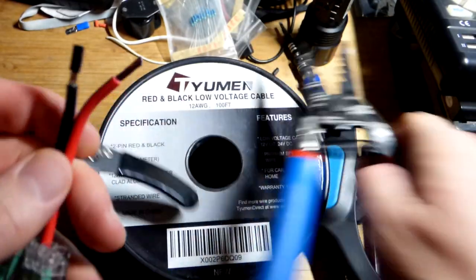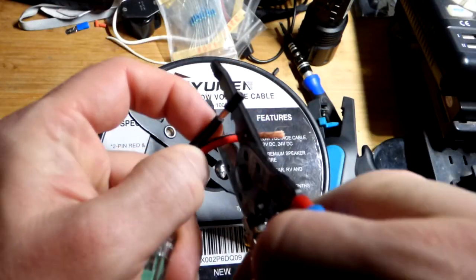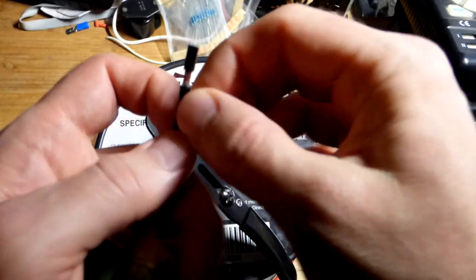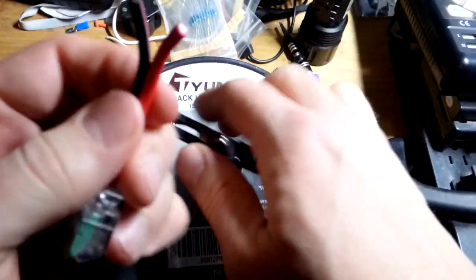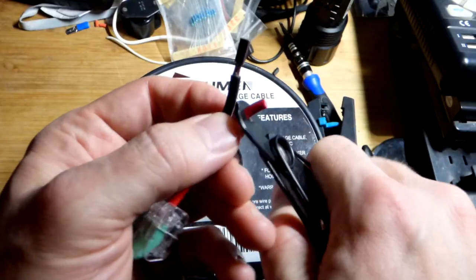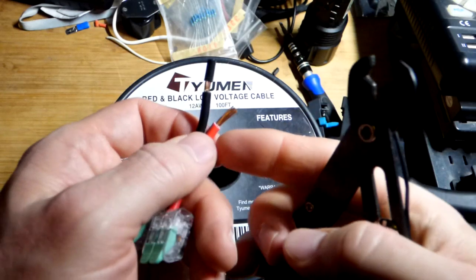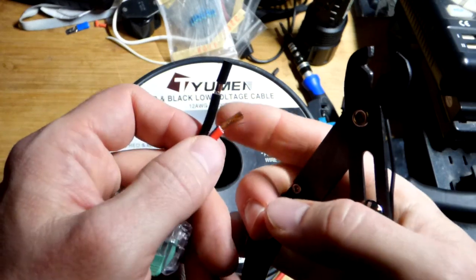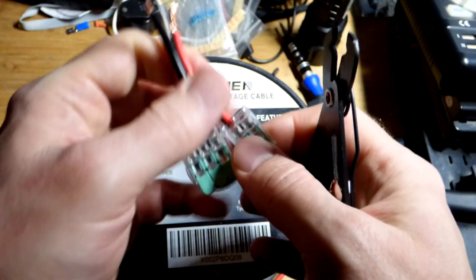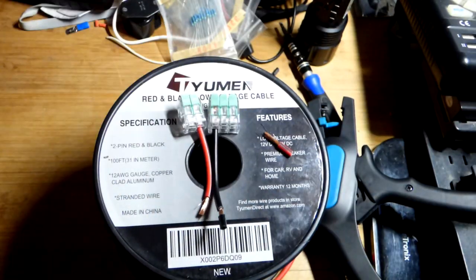As a single tool that one was more expensive. The cutter did not work well at all — I had to cut with that one right there, which works really well, so it's already deficient to the Klein in that aspect. I think you can adjust it, but I just squeeze it. It came off really easy right there, though it does kind of nick the wire — it doesn't do as good. Some strands did come loose even though I secured it, so be aware of that. But in any case, hope you enjoyed.